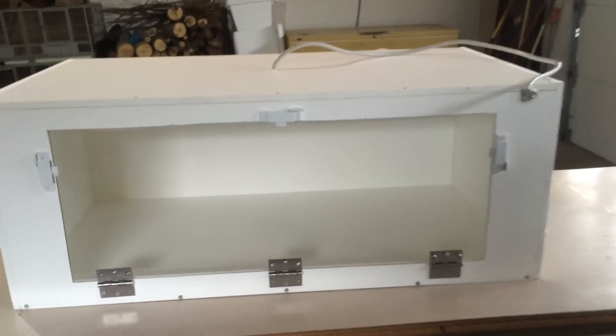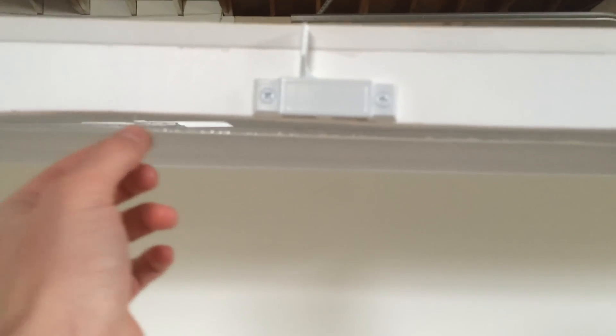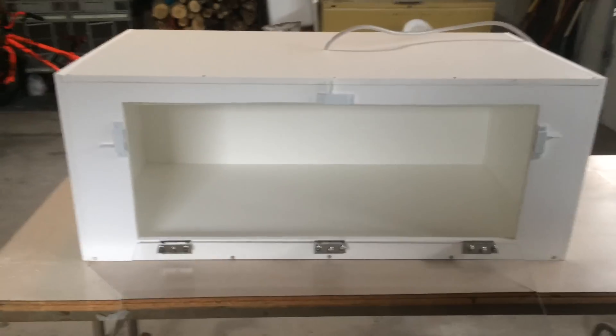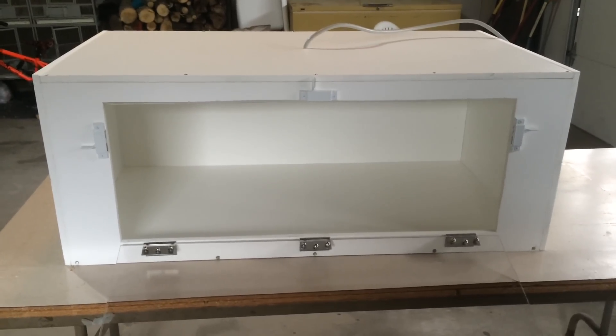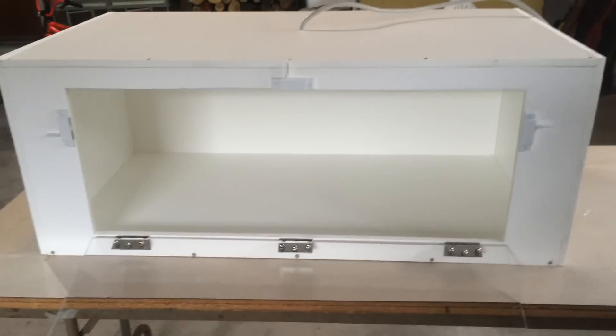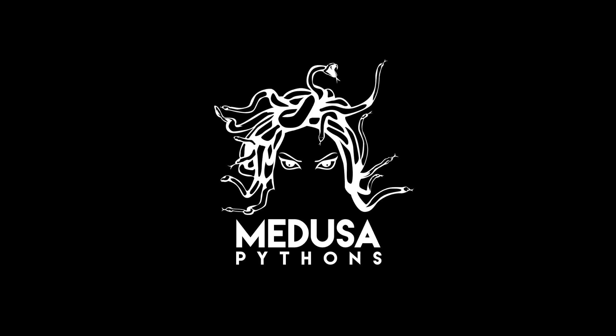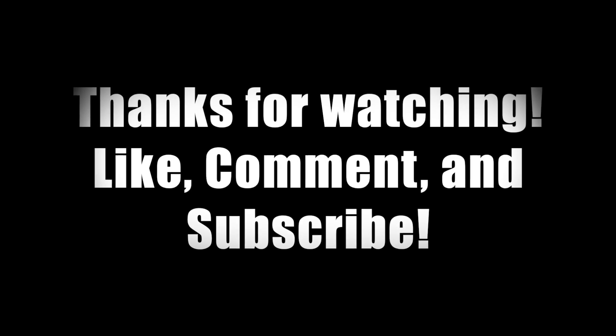So here it is, all done. This is the finished product. You can see how it works — latches open, real easy, door opens. You can see the lip that it fits on, the acrylic lip — it just goes right up against it like that, and then you close the latches. And then off camera I also installed this LED light. These are really nice — you can get them at Menards or Home Depot. You just screw them into the top and wire it onto a spare plug. This PVC material is super easy to work with — easier to cut than wood, really easy to glue and screw, and it holds screws really well. So anyone that wants to build an enclosure like this, I'd highly recommend using this half-inch PVC. Thanks for watching guys, we'll see you next time.